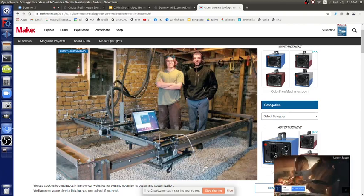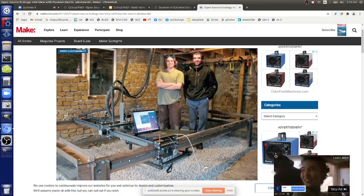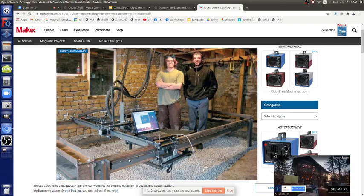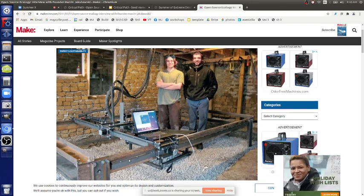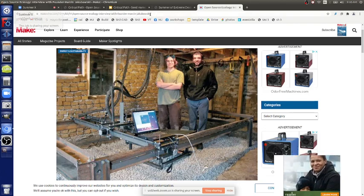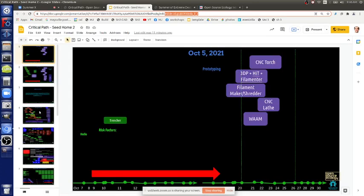There's only really one well-controllable pin that we have ready access to through terminals. There's D8, D9, D10. D9 is open. The other ones are connected to the fan and the heat bed. Just the one, because the two other ones require thermistors, so you have temperature sensing, and that complicates things. So you've got one, but you got plenty of pins on the Arduino Mega. We talked about this before a little bit.